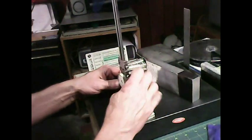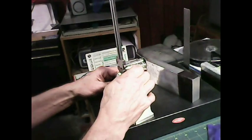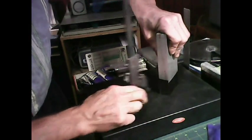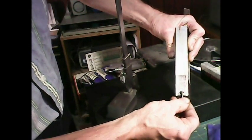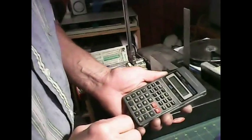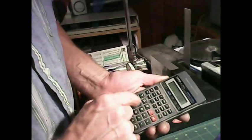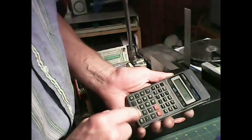So let's make that 425, 1/8 more, 125 more. Yeah, it looks better. The head of the screw sits here, gives me 1/8 of an inch wall thickness, and then, okay, that'll work real good. Alright, so I'm at 0.425 right now, plus 0.375, that gives me my 3/8, which is half the 3/4 diameter. And so now I move that up to 800 thousandths.